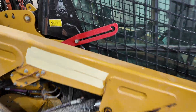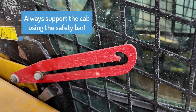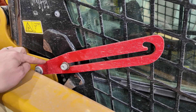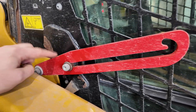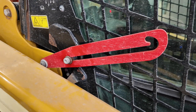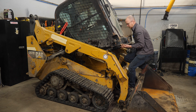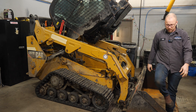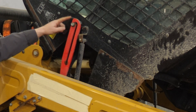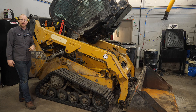There is also a red safety arm here. As we lift the cab, we want to lift until this bolt comes up into the keeper — at that point the cab is held up mechanically. We never trust a hydraulic strut to hold up a cab, and we don't use wood blocks either. We must rely on the safety link. If these are missing, communicate to the customer that they need to be replaced. Push up on the top of the cab — it's hydraulically assisted. If it feels incredibly heavy, the gas struts have failed. Push up until the lock arm engages and the cab is held up mechanically.